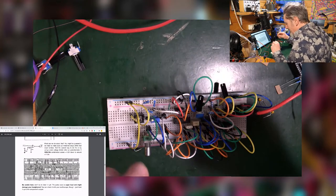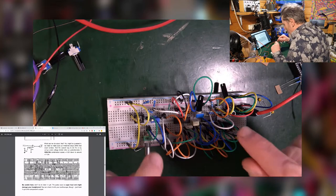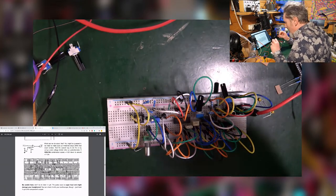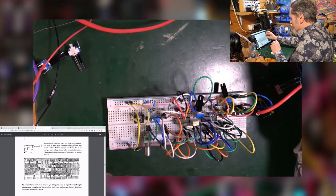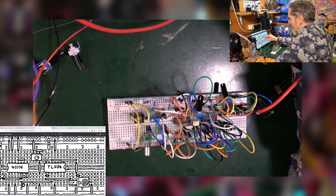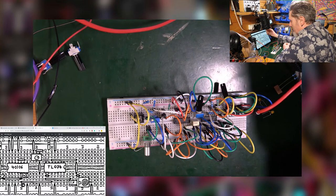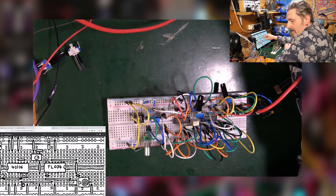And why was that? So I went back through it, took bits out, put them back in again. No, it's right. Everything is right in reflecting the breadboard, but why can't I hear it? And then at that point I realized that here in the op amp, the output of the op amp that's creating the square wave is this pin 7, and pin 7 is connected to nothing.